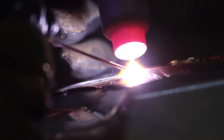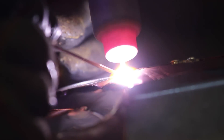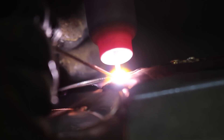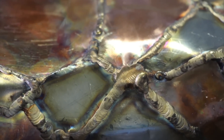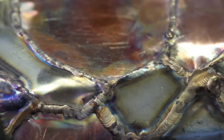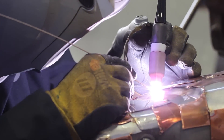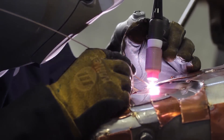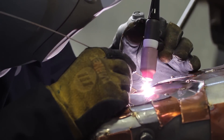What we're going to end up doing is really hard. We're taking really thin copper and really thin stainless — it's 22 gauge. With the way they have different melting properties, when you're filling in with the silicon bronze, they melt differently. You're trying to fill it in and make a nice even bead, and sometimes it works, sometimes it doesn't. So I'll be mixing in different finishes and different sanding techniques. Some of the beads will be raw. Then we're going to clean it up, clear coat it, put it on the bike, and see what it looks like.